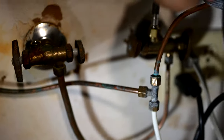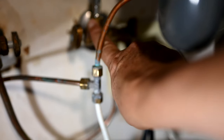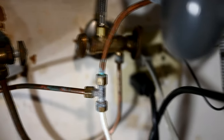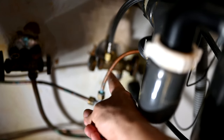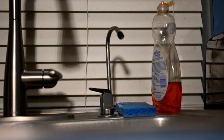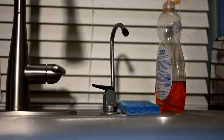This steel-belted hose goes up to the cold water faucet. The double valve has a three-eighths-inch outer diameter connection and a quarter-inch diameter connection for the ice maker line — ice maker lines are always quarter-inch. The line comes down out of the double valve, snakes around the back of the cabinet floor, and works its way into the front of a water filter. The water gets filtered, pops out the other side, comes back around and hits a T-fitting. The top of the T goes up to a water dispenser at the sink — a classic combination many people use.